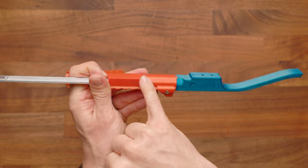Now install the barrel — it seats in the o-rings in the turnaround. Make sure the thumb screw is retracted enough to allow insertion, apply a little pressure to seat it fully, then tighten down the thumb screw. The plastic thumb screw won't hurt or scratch the barrel. Note there are two o-rings in the barrel, so no lubrication is needed — the dry-fit o-rings will make a great seal on their own.